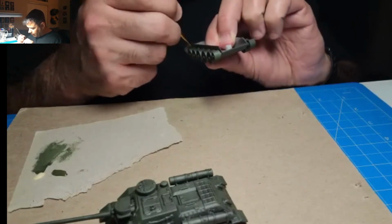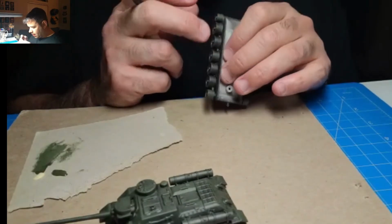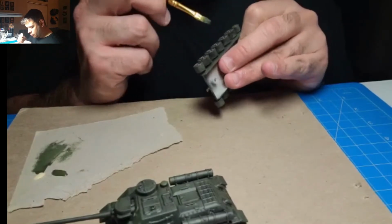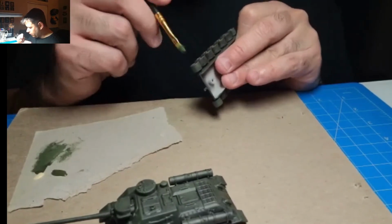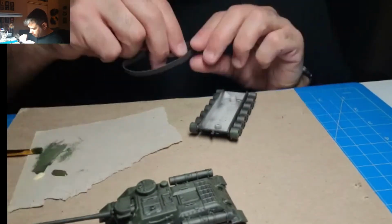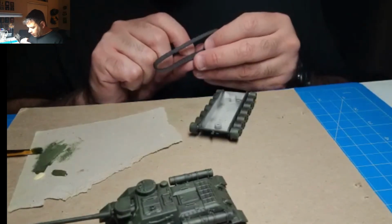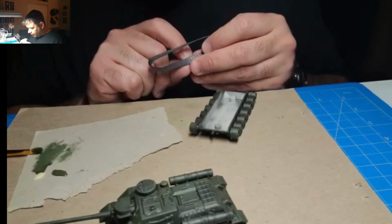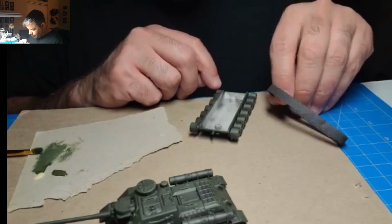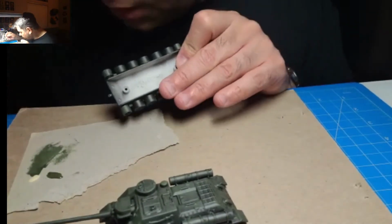And the unique thing about this vehicle, it's a T-34 chassis. The unique thing about this vehicle is it does not have a toothed sprocket wheel. It's a rubber band track, so it doesn't show it, but the teeth actually are on the inside, and they're every other one. Every other one of these has a tooth that's in the middle, and it rides basically on the center of it. So it seems like it's a better system, honestly.